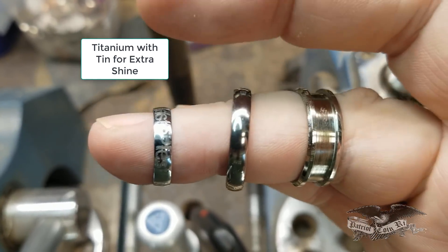The second test is anodization. You can anodize in a couple of different ways — one way is using a power box or strong battery. For titanium you need about 18 volts, which is more than a car battery. But you can also anodize using a flame, and I like using flame more simply because it works much faster. Since this is real titanium, it's not going to take long to anodize.